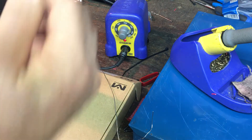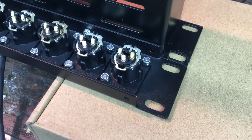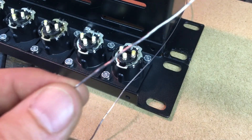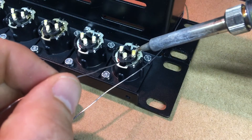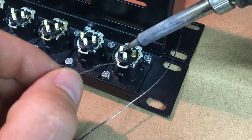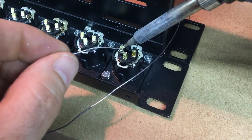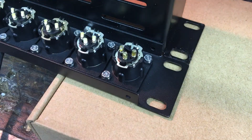Now let's go to the cup. The tip is still clean — we've got a little bit of junk on it so I'm going to wipe the junk off on the wet cloth and get it wet. Heat transfer is what you're going for. That wet solder on the back of the cup will help move heat into the back of the cup. I'm touching the back of the cup, giving it a little bit of a chance to heat up, and then I'm trying to melt the cup full of solder. I do this on every single cup — I think this is the secret to good, easy soldering. So those cups are full of solder, heated by heating the work, not the solder.